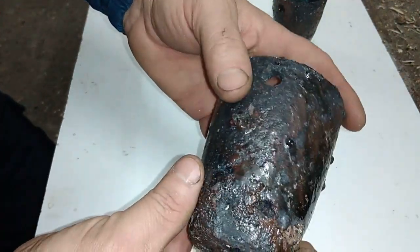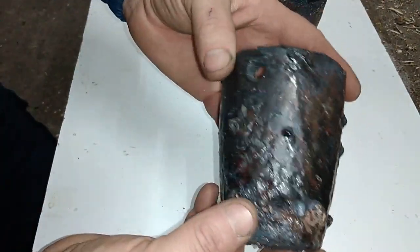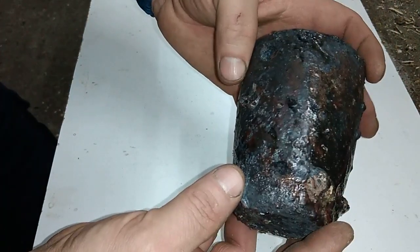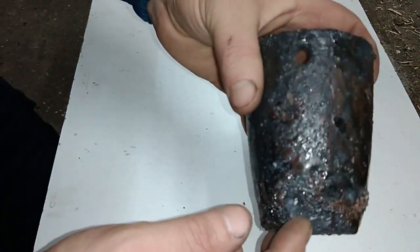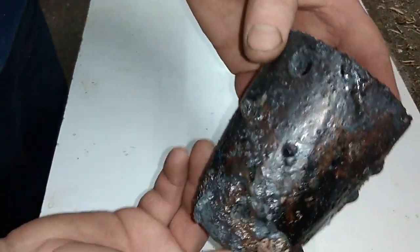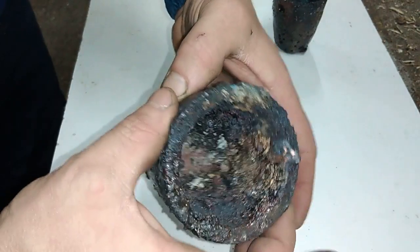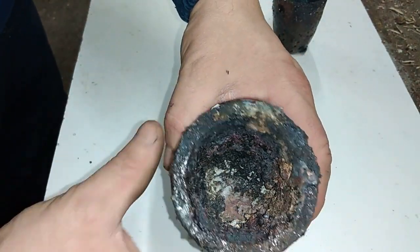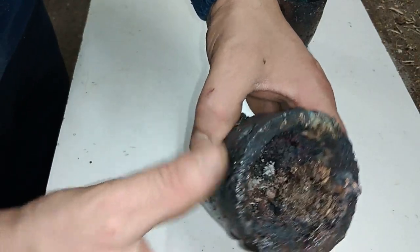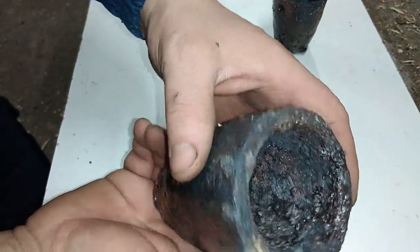At the end of the second day I noticed when I started to pour that I didn't have as much copper as in the beginning. I realized a lot of my copper actually went through those holes into the charcoal. This graphite crucible is no longer usable. I always make two holes with a drill because it's much easier for me to catch the crucible in the charcoal using a vice. Like I said, borax will destroy your crucible — not immediately, but after some time, definitely.